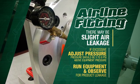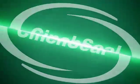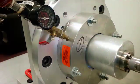Run equipment and observe whether there is any product leakage. If so, air pressure may need to be increased. Now your CinchSeal replacement installation is complete.